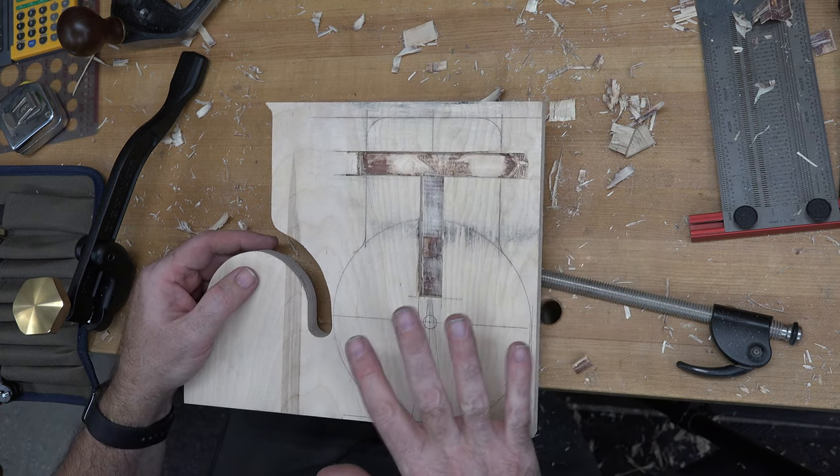Our next piece to make is the gusset. For that we need to measure here to here, and if you remember that was three and a half inches — we'll verify that, and yes it's three and a half inches. We'll mark on our piece of ply three and a half inches — this will be the width of our gusset. The next thing you want to do is measure the depth of your dado. It doesn't matter if it's the same as mine — however deep you cut it — but you want to put a line at that mark. Once you get that done, run a 45 degree angle from this corner all the way up, and that's where we're going to cut it — and that will be our gusset.